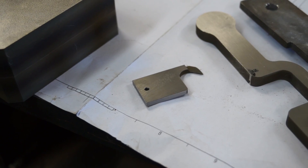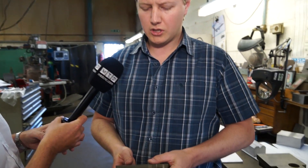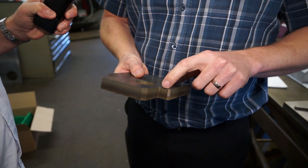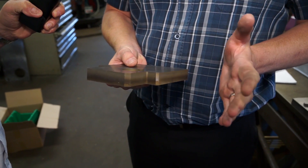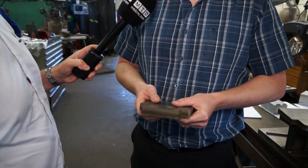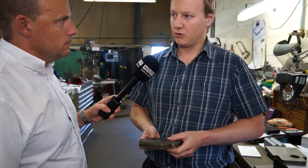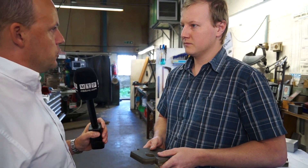Some of the parts we'll look at — I often wouldn't know whether to mill them or wire cut them — but you've got an interesting slant on that. So this is interesting because this could quite easily be milled, but of course you're wire cutting it. Where do you see the differentiation? Well, for a start, when you look at small inside angles like this you have to get quite a small radius milling cutter into that corner. Yes, you can do a tool change or try to mill the entire piece with a small diameter tool, but by the time you've programmed that and set the tools — even though the milling process might be quite quick — on a single-off like this, wire cutting is going to be a faster overall time. The actual cutting might take longer, but the overall production of the part is going to be quicker.